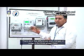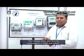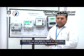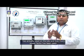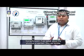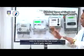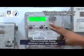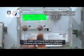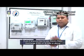There are a few differences in the three-phase meter since three phases are used. It also records consumption in KVAH and KVARH, allowing us to check the actual load and power factor on the meter. This meter is also tamper-proof: if someone tries to remove the top cover, there is an immediate display showing a cover-open symbol along with date and time stamping. The meter is immune from any magnetic influence, radiofrequency influence, and even electrostatic discharge (ESD) of 50 kV or above — any tampering attempt will be displayed.